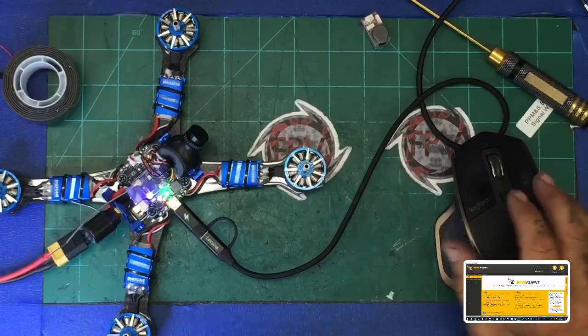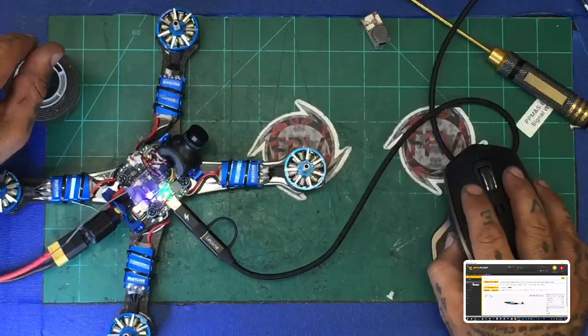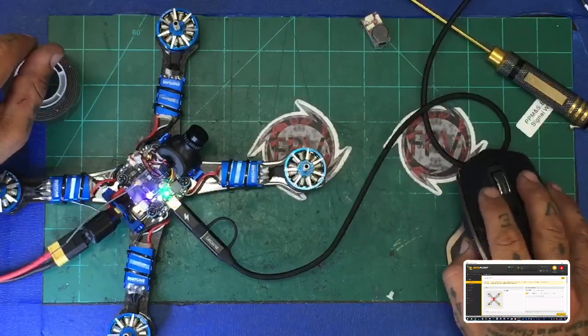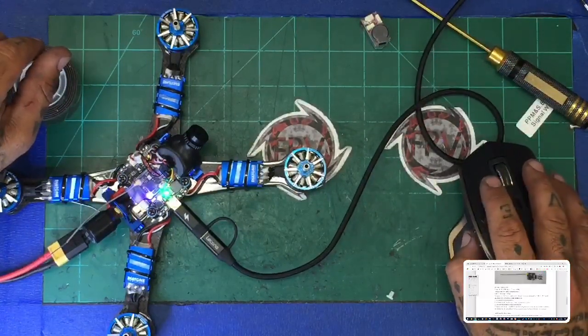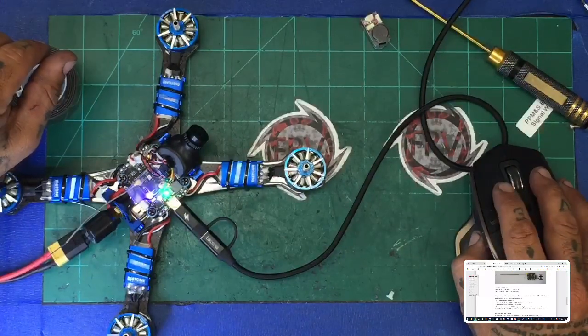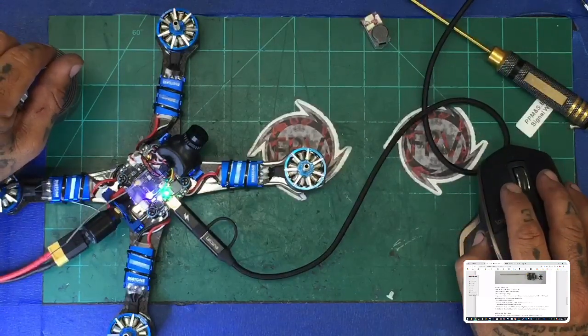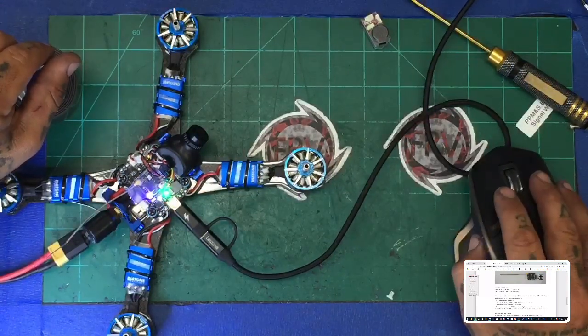Yeah, so the instructions on the site say to press it twice very quickly. At least that's what I read. I will switch back here and see, because it says right here, how to match the code with the transmitter. Place the transmitter receiver, turn it on, press the black button on the stick. There's a black button on the thing. Press the binding button twice in 2 seconds and release receiver.